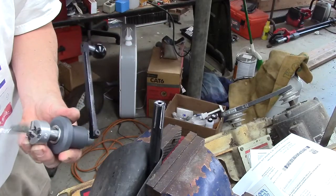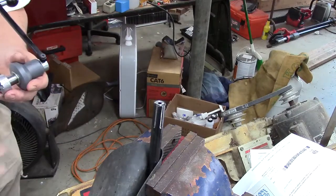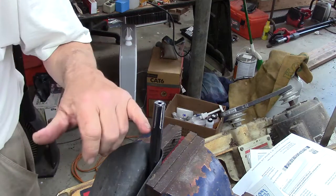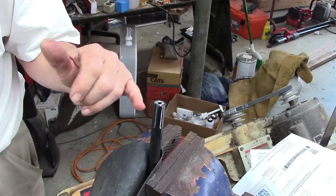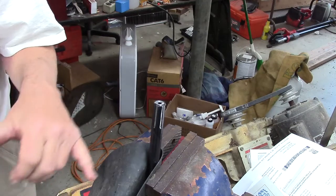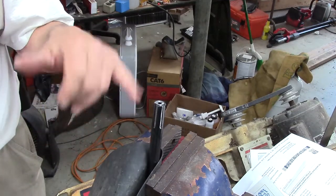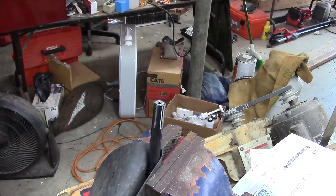But when I pushed a pellet through to judge where to cut that choke off, I noticed as the pellet went down the bore that the bore's inside diameter is variable. You get tight, loose, tight, loose, tight, loose. I'm wondering if where I cut it, just before the fakey choke, which is what we wanted, might have also been in an area where the barrel was looser. So I want to push a pellet through and see where the last snug spot is. If it's within an inch or so of its current cut length, it might be worth cutting it back to that and seeing if it tightens it up.